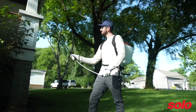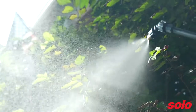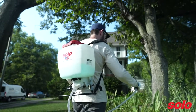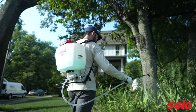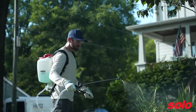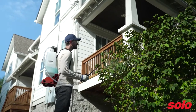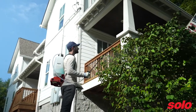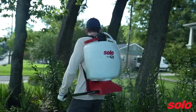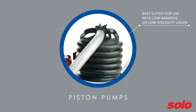Unlike handheld sprayers, backpack sprayers only pressurize a small one-liter chamber inside the tank. The backpack sprayer forces liquid into the chamber, which pressurizes the air already inside. A four-gallon backpack that is completely full of liquid takes about 10 pumps to reach working pressure. If that same tank has only one gallon of liquid, it still takes the same number of pumps, because only the inner one-liter chamber gets pressurized.